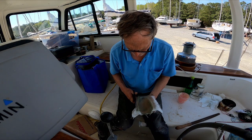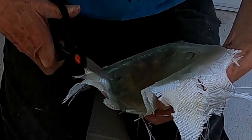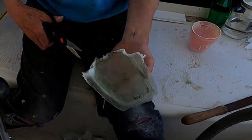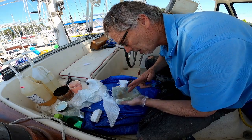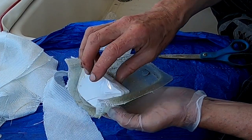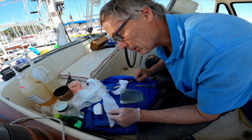It's good to have a pair of scissors just for doing fiberglass — these are pretty well trashed for any other work. I've trimmed up the mold and put another layer of grease inside. I also made a plug covered in tape to form the mouth properly. So let's get some epoxy going.